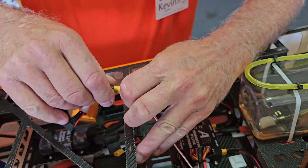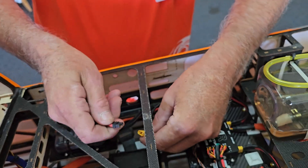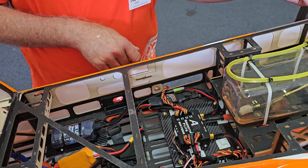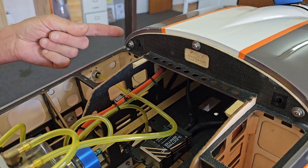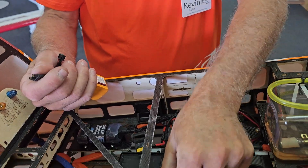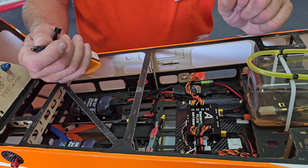If anyone has any questions, please leave them in the comments and I'll answer them as I can. In a nutshell, that's how to best use the electric start and how to isolate it when you turn your receiver off, so the ESC isn't beeping. Let me demonstrate — turn the aircraft off. If I plug this directly into the ESC it will sit there beeping all day, as you can hear, and you don't want that. So if you don't want to use a switch, when you've landed just unplug your battery — that's as simple as it is.